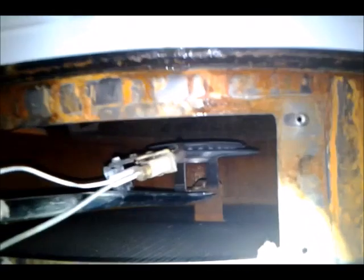So we got it screwed in, pretty deep threads, pretty long threads. Takes a little while to get it in. Tighten it completely with the crescent wrench. Okay, that's pretty tight. We don't want to bend this downwards so it doesn't shoot the gas up into the burner. So I'll hook the other end up.